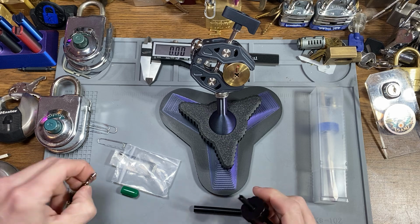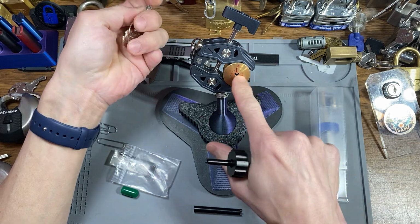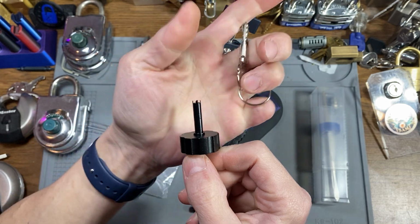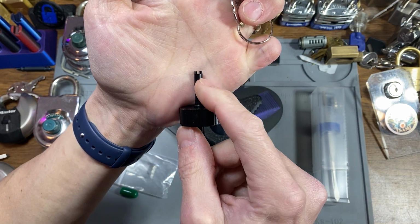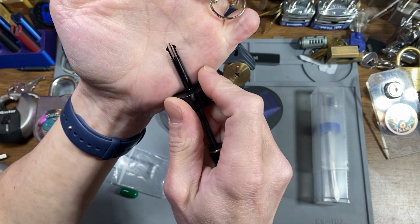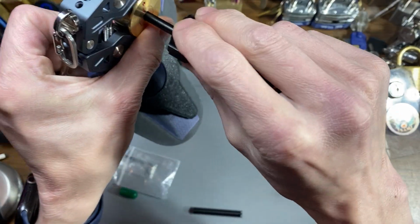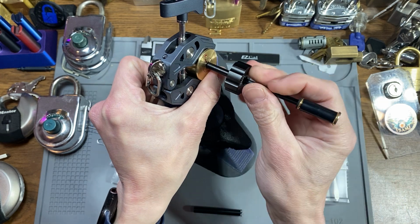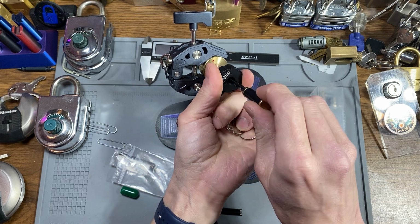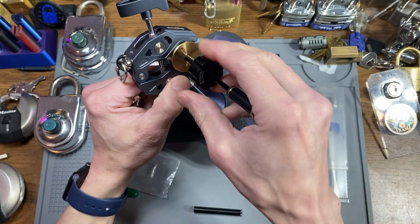These cross lock picks. You can see your key right here, and it is notched because it's indexed. There is one wider slot on these. Normally you're tensioning with one of these, and you can see just the very tip of the teeth are tensioning, and then the rake is going to come up inside the lock. You set it inside your lock, and then you drive your rake down in as you apply your tension, and there you go. You can see right there, rake it right open.